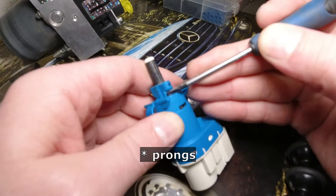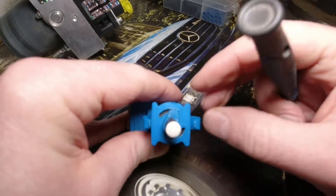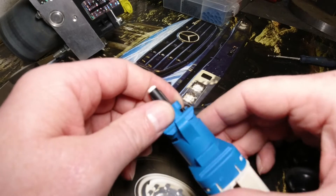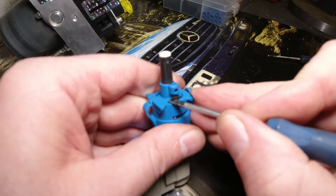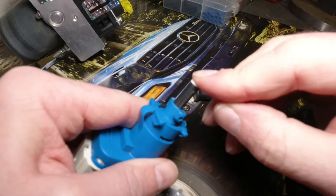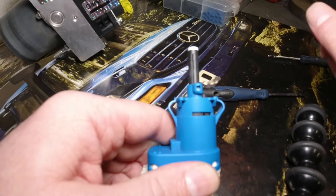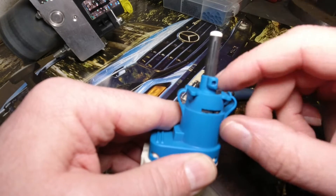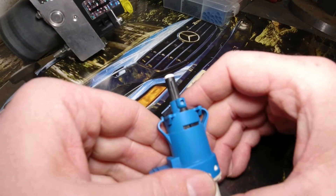There are these two black plungers hidden behind the actual bayonet mechanism - you can't even see them when you look at it from the top. They ride in line. What happens now is if you install the switch and you twist it counterclockwise, these black plungers or prongs move along in this groove. Watch what happens now if I do that - the switch jumps out and now the switch is actually functioning. You can get a contact and connect your ohmmeter back here and check it. This is releasing the plunger when you twist this mechanism.